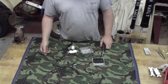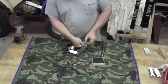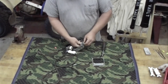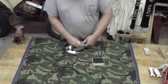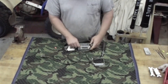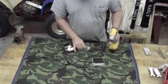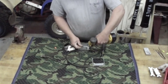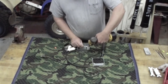With the male end on there. Take your Romex connector and put it in your box. Get it in there nice and tight. Take your wire, push it through, and then tighten it down on your wire. Get about an inch of insulation in there — you want about 3 or 4 inches of your bare wire hanging out. Tighten it down on it.